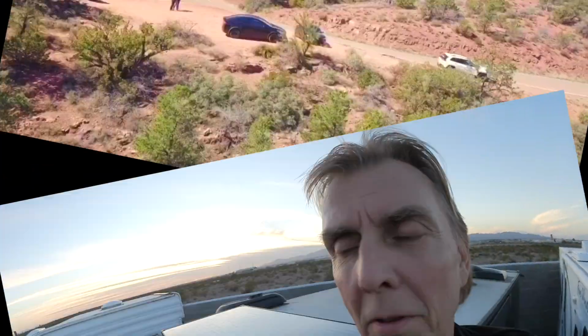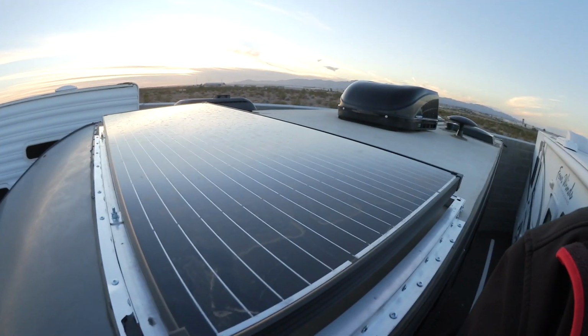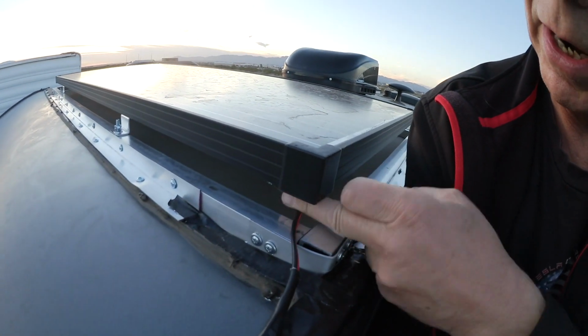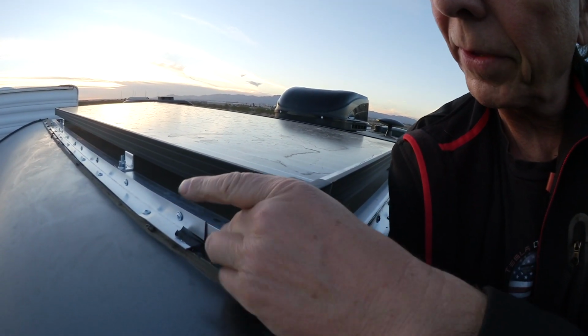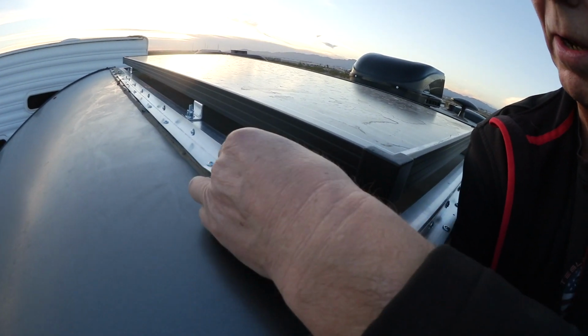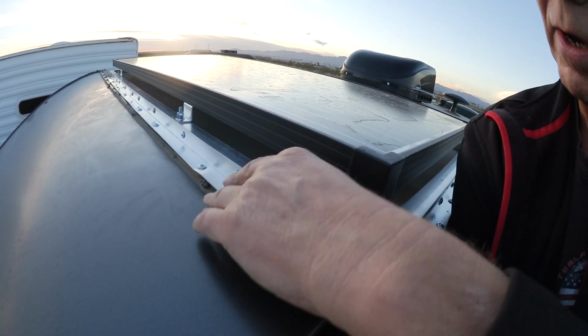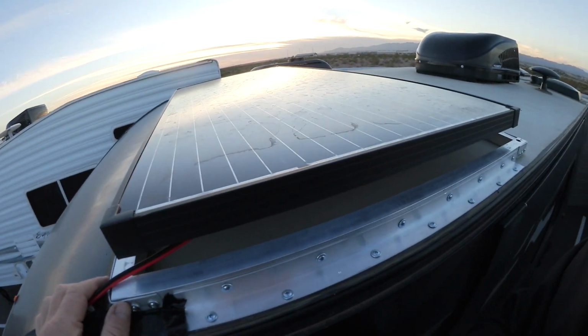This one here is the solar panel, but you cannot install it directly on it, because it's just getting too hot in summer. So I have about an inch of a difference here, and this is on a square aluminium frame, and that aluminium frame is then attached on both sides on an angle. An aluminium angle here on the front, and then here on the side.